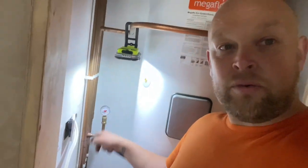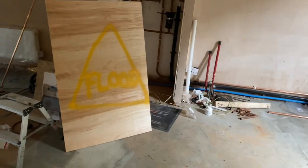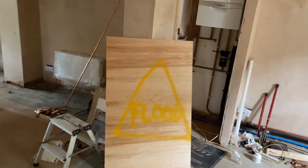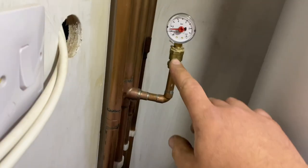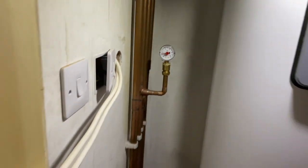Whew, pressure. It's just a massive relief to have that holding. If you've been on big jobs, you'll know. It's Friday. Never finish on a Friday and I'm doing it. Breaking my own rules. Look, flood. These boys take the piss. Just one vent plug. I'll be happy with that. Here we go, look. 3 hours in, still holding pressure. Perfect.